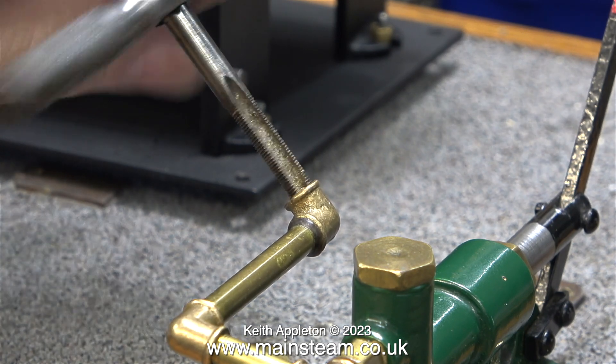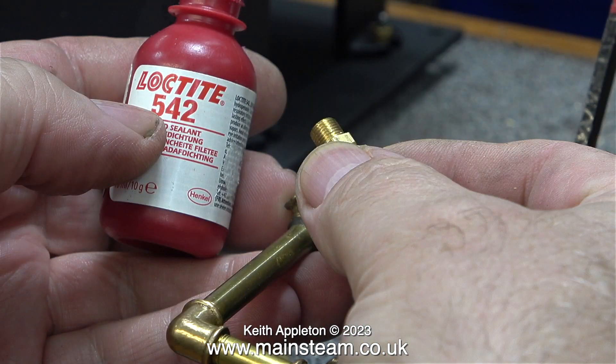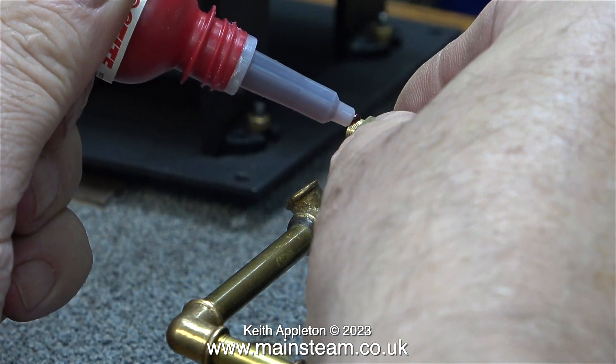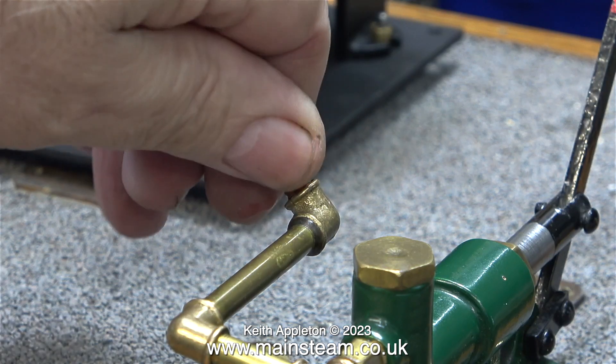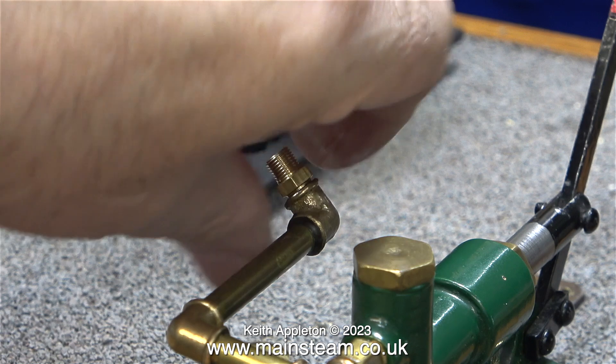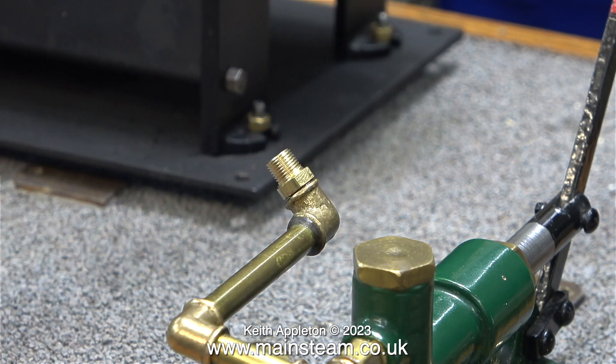All the PM Research parts fit together perfectly, but I want to fit one of my stock English double unions because at this point the piping changes from the modular system from PM Research to a length of ordinary copper pipe which runs right past the burner and up to the check valve on the boiler. Originally I did think about coiling this copper around the burner, but I changed my mind — the water will be warmed sufficiently by the pipe going right next to the burner, which gets very hot.